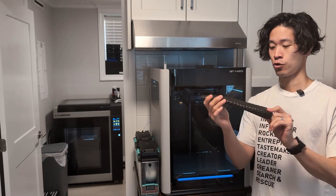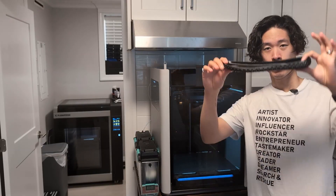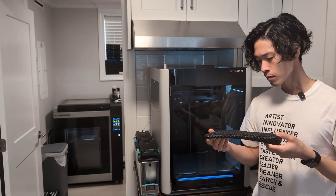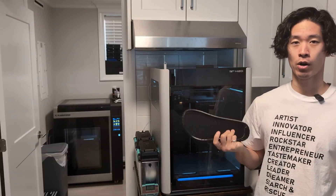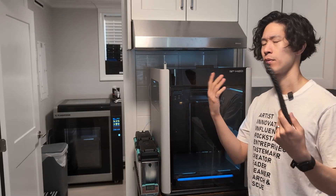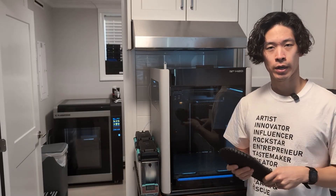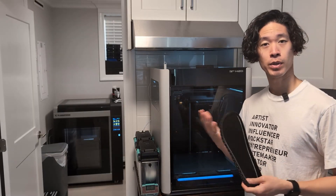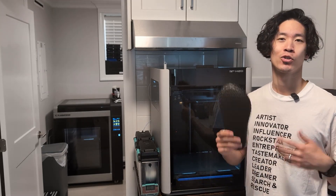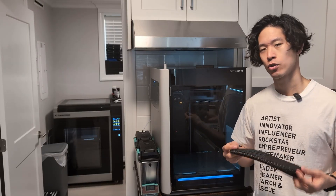This part in general has a lot of texture and some strange geometry. It's not flat — it's got some organic curves to it — so I thought, why not use what this machine is designed for and run TPU with some other dissimilar support material? I did some research online. Seems like people often use PLA or PETG as breakaway supports for TPU, and that's what I did. I'll show you how I got this to print successfully and the tests and failures along the way.